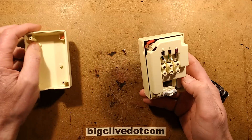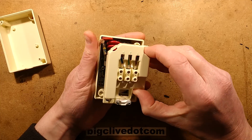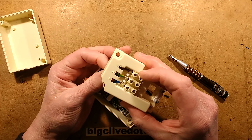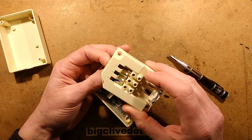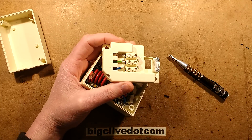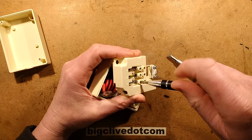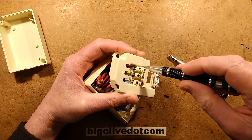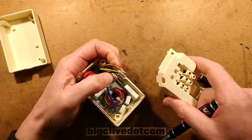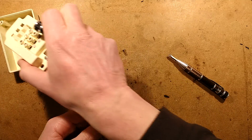So this is a plug. It's got a little neon stuffed up here that goes up to match the connector there, so it is designed to be terminated into plug style. The earth wire looks tight - it's just the actual thing moving about inside there. Let's get the wires out; it'll make it more accessible. The crimping seems quite nice construction at initial glance. That is the point you'd terminate your flex into and it's got a cable grip, so it's quite good in that sense.